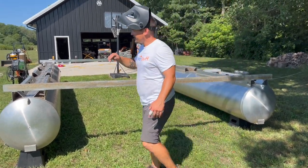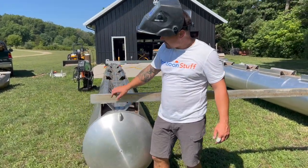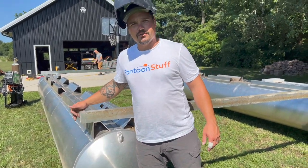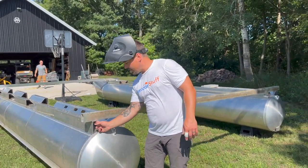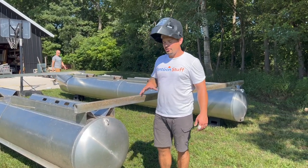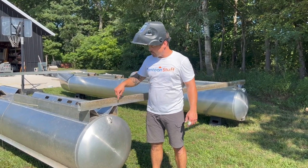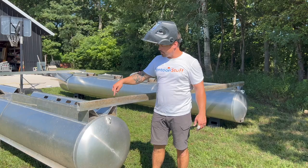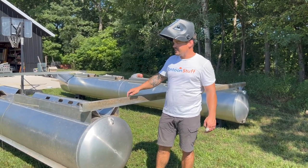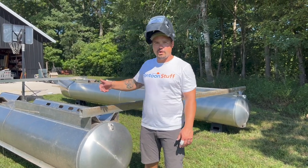What we're doing on all of these — Corey's drilled all of these — they're three inch by two inch rectangle tube. We're bolting the outside, and then the faster, easier way to do this is to weld. So we're just MIG welding the inside tube together. That way we don't have to put a hole through the top or get access through the side. If there's 13 or 14 of these, it's going to be faster, easier, and just as strong — if not stronger — to weld them all in.